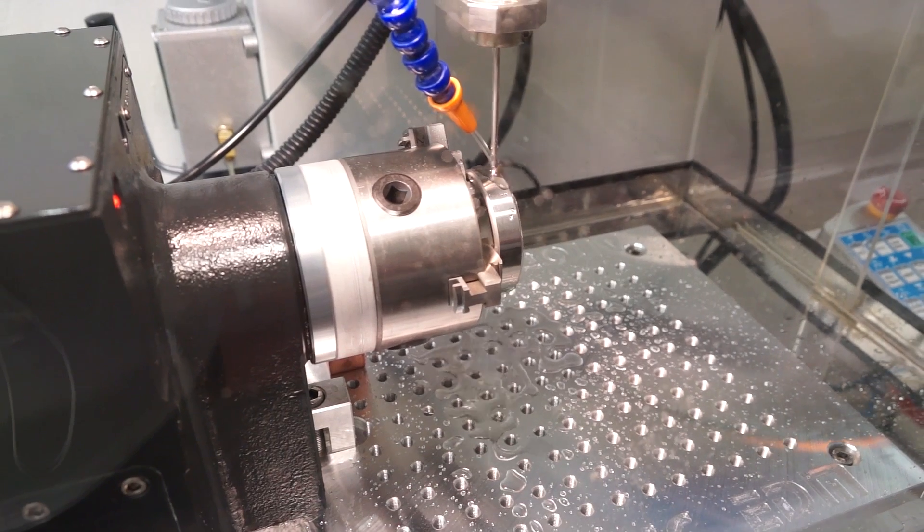How about aerospace, maybe carbide manufacturers? We've sold a couple of machines to some high-end carbide tooling manufacturers, purely and simply for putting cooling holes in specials. Obviously the standard tools are normally done in the green state, but anything that's bespoke has to have cooling holes in — and that's why our EDM lends itself.